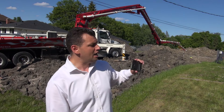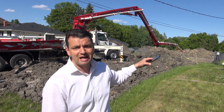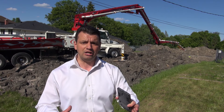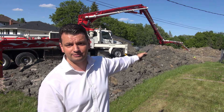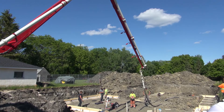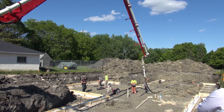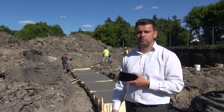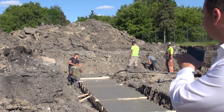You can see the big pump right here with the long sleeve pumping the concrete from the trucks right to the job site to pour the footings. This huge pump has a 125-foot reach, which really helps because our house is located far deep into the property — more than 100 feet from the property line, far from the street. Right behind me you can see the guys pouring the footings for the retaining walls: the pump supplies the concrete, the guys guide it into the form and level it up for a nicely finished footing.